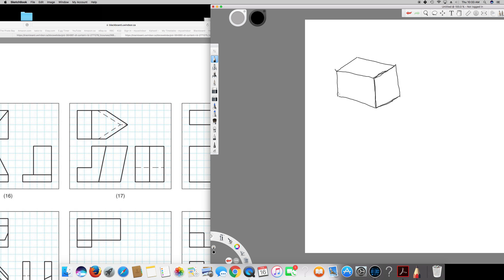Now we have to think about what we can do with this picture. If you look at the front side, there are no hidden lines — that means there's no part after this point. So from 2 boxes across and 3 boxes high in the front view, there's nothing beyond that. From the top view, this part is covering the lower portion, so after this point it's hidden.